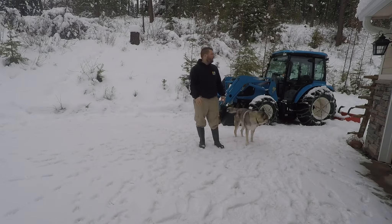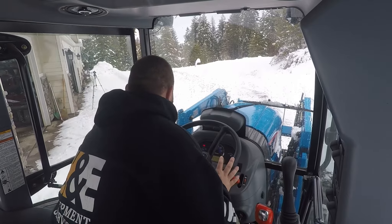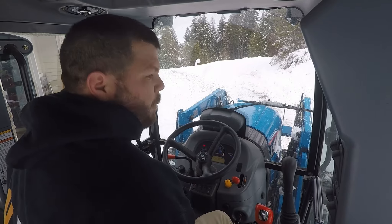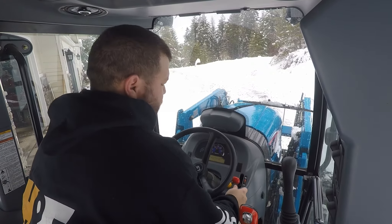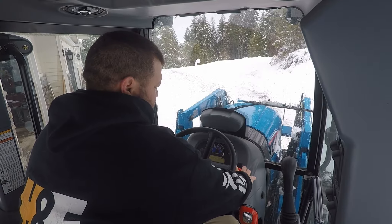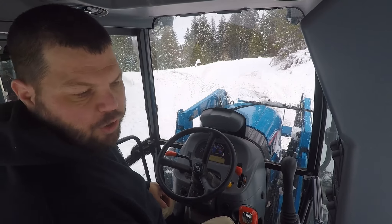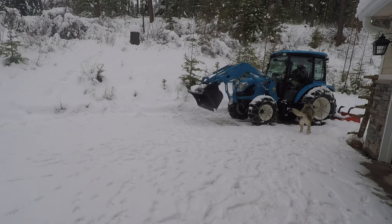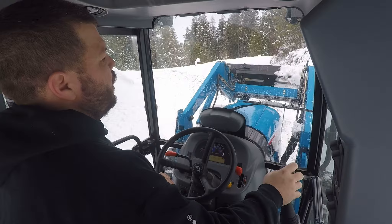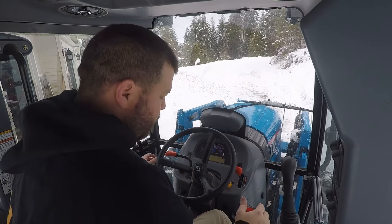It's been about a half an hour. The tractor's all nice and warmed up. Going three range, drop the e-brake. I'm going to start off in two, forward. I'm revving it up to about PTO RPM. Make sure that the box blade isn't stuck, pick the bucket up. I'm watching the indicator — I want the bucket level right about there. And I just put it in float. Make sure everything's right, and away we go.